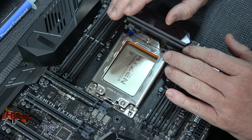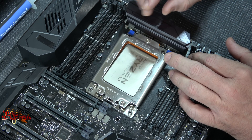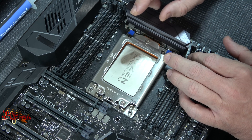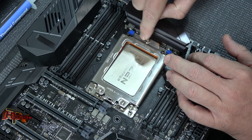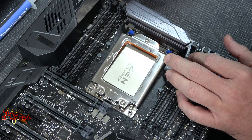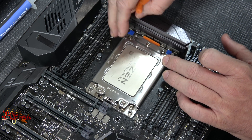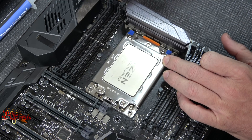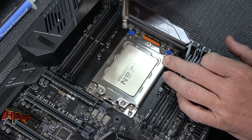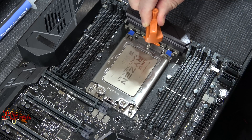This is the remedy — I've installed a whole bunch of these processors on a myriad of different motherboards. All the TR4 sockets have been the same. I hear people saying the threads are too short on the sockets, and honestly if you follow the directions and torque all the way down the first time around you may run into that. Here's a really easy trick — if you've got the Torx wrench down in there good, you're not going to slide off.